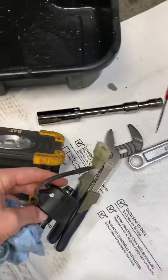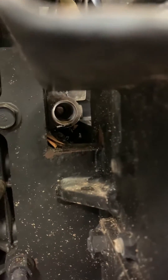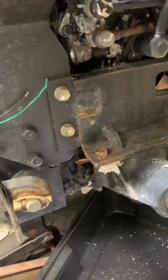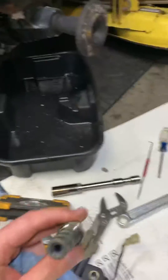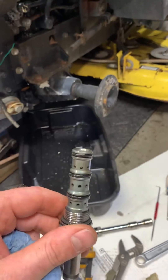What you're going to want to do is take off your solenoid — it's all in the back of here on your control valve. There'll just be a nut. You pull the solenoid off, and then with a 27 millimeter wrench, the shaft comes out with the valve. You're able to take the valve out, and that's supposed to move in and out with spring tension.